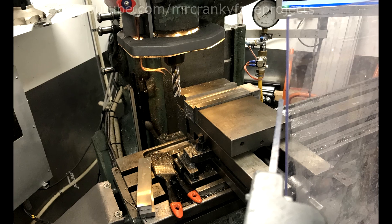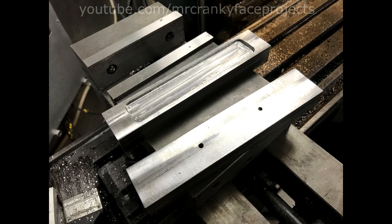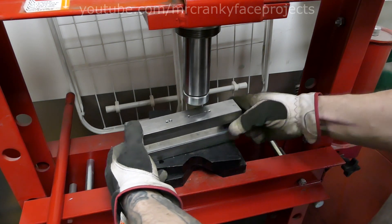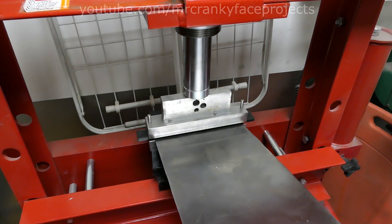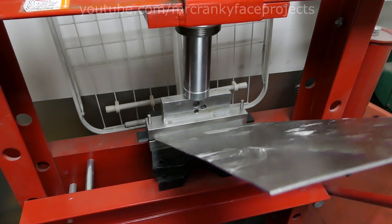The original form was designed for 1.2mm flat sheet, which turned out pretty good. You need to take the thickness into account so you don't pinch the material when you press down. The operation is pretty simple: assemble the press, insert the sheet being careful with the alignment, then press down to the required depth. If you press too hard you will scar the sheet; if you press too soft you won't fully shape it.